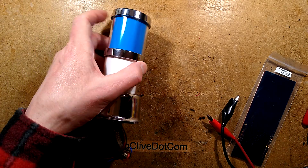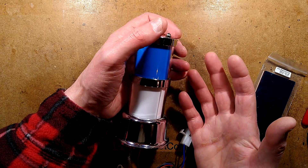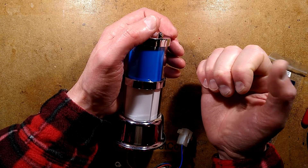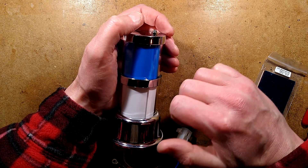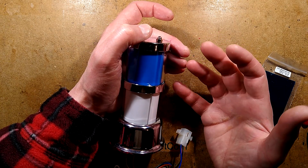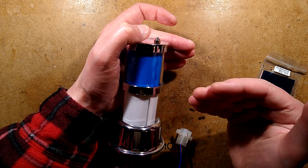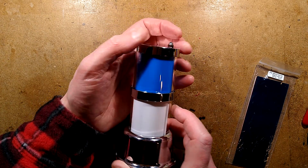In the early days of arcade games, people used to get free credits on machines like Space Invaders by using a piezo electric spark from a clicky gas igniter. They'd put it on the coin mech metal frame and just click it. Because they didn't understand grounding, the spark would jump onto the coin mech and actually trigger credits — or it would damage the circuit board. But the people doing that didn't really care about such things.